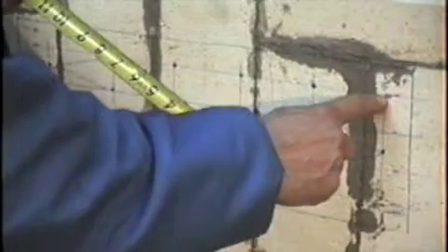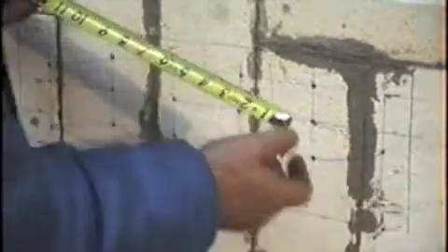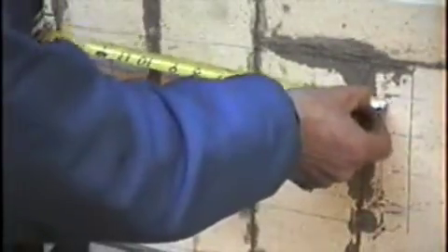So that's the end result. The next thing I have to do is stretch the element, which is a tightly wound coil, to the correct length to go back and forth here four times. So I have to measure this distance, starting with the hole right here that goes down to the controller, all the way. I'm right at 60 inches. There's a lot of distance now between the coil rotations.